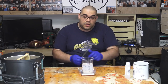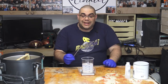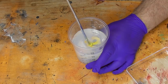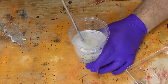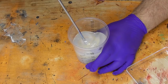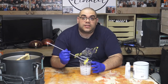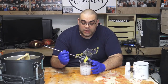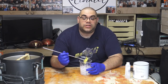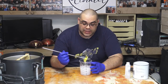To help mix it together I bought one of these off Amazon — just a steel rod with a nylon mixing attachment at the end that you put into your drill. With them both being clear I've no idea how well it's mixed. I've introduced a lot of air doing it this way, but this stuff is really thick and I didn't fancy doing it with a spatula by hand. I'm going to put it in the pressure pot, so that should solve the issue with the air bubbles anyway.